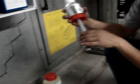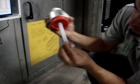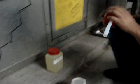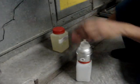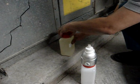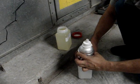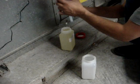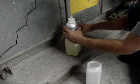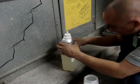And check it for cracks in the lid, missing or clogged screens on the bottom of the bottle, or any other visible damage you might note. Next you want to store the head in the empty bottle, and open the new cartridge. Careful not to spill. Insert the head into the new cartridge, ensuring that the lid is tightened down completely. You want to make sure that it's on there straight. That's why you have to be most careful.